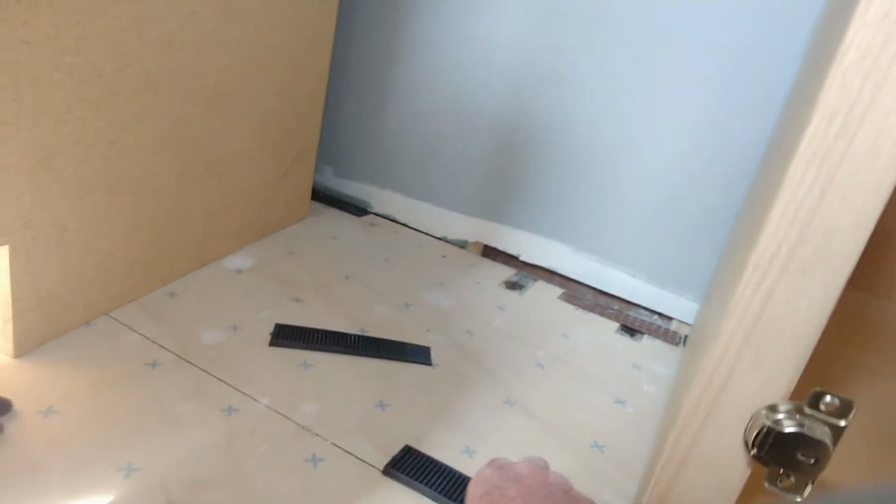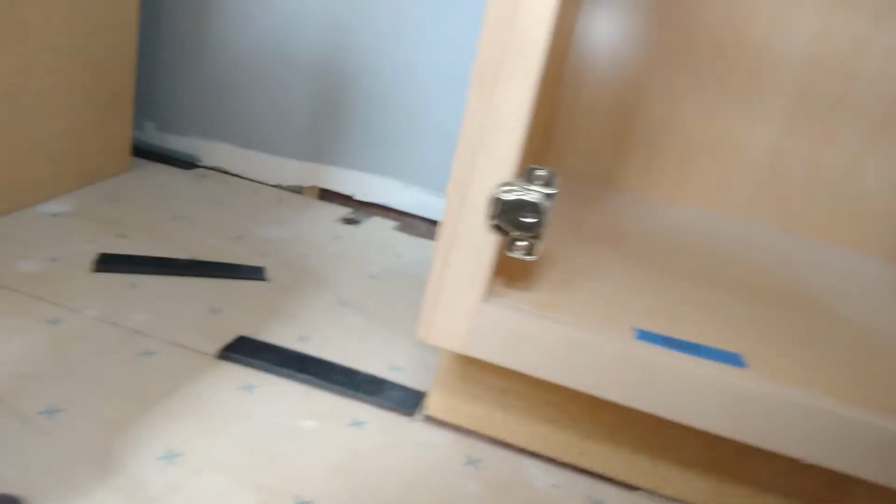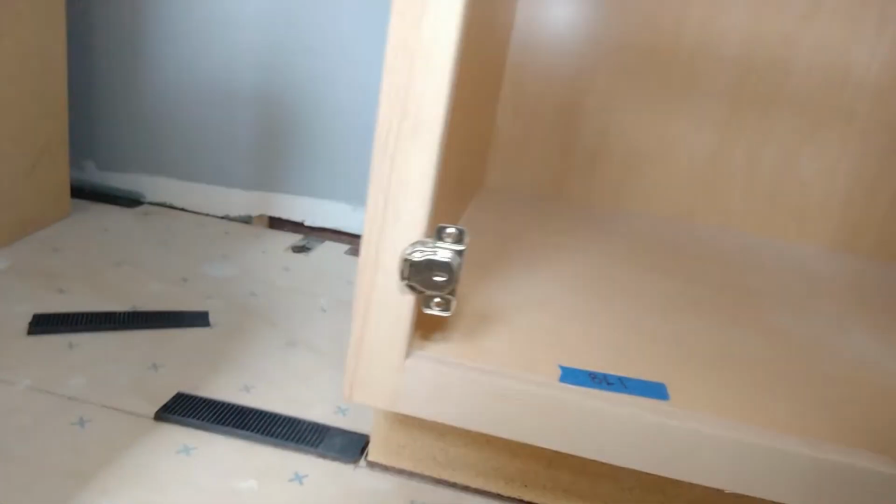So we have this bottom shim stapled to the floor, especially for in the back, because that is so difficult to get that one in there and get it in place. And then we just need a little bit more to equal the height of the shims that are here. And you can see we have one full shim and a little bit of another one. Nothing is anchored in place yet, but we're getting really close to doing that here in a few minutes.